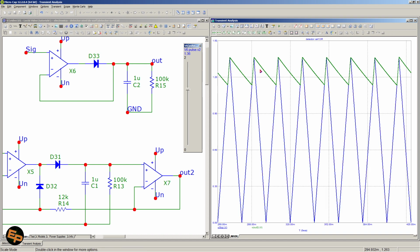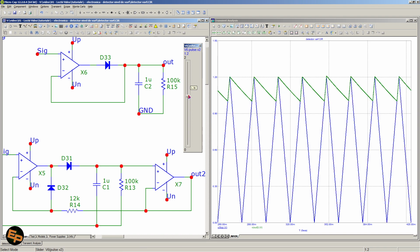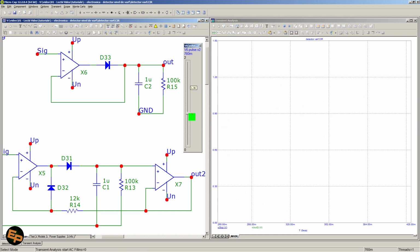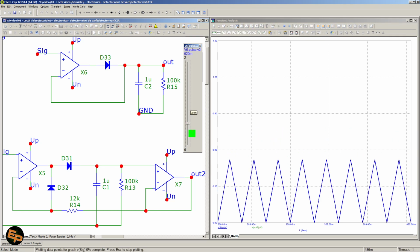However, well, I said positive. It's not like it's on a positive edge. It's more like, you know, when the input is higher than the capacitor, it works instantly, and then the capacitor starts to discharge, and it discharges a lot quicker because of these smaller values. However, what we clearly see here is that because the op amps are not going into saturation, we have a consistent time of charge and discharge no matter where we are in this signal, okay? And we can make the input's amplitude lower or higher, but we see the same consistency across time, basically.